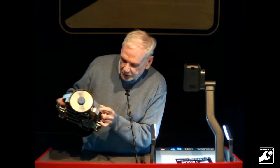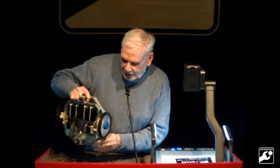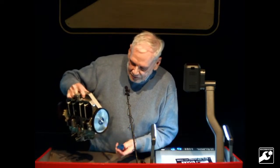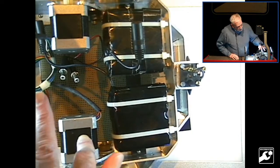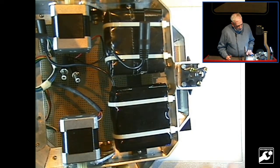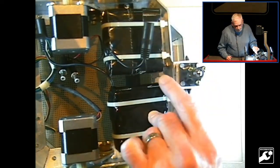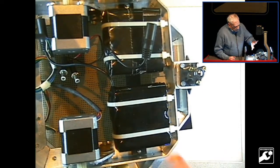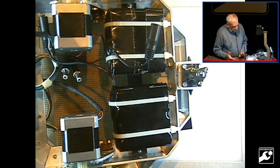Let me just describe what I've got here right now. That's just 1-inch angled aluminum, 2 pieces, 1/4-inch plywood wheel, milk bottle top, roller blade bearing, CD wheel cover. These are stepper motors. They sort of work, but not quite. These are lithium-ion batteries, 14.8 volts each. Pretty pricey. Casters, ball casters. The gears are just cheap plastic, and the wheels wobble. So, still not satisfied with it.